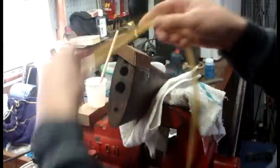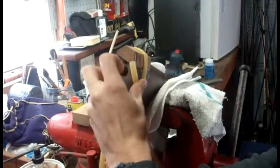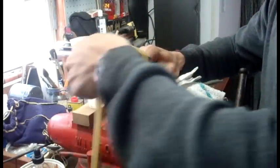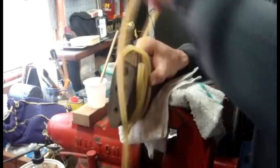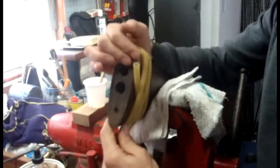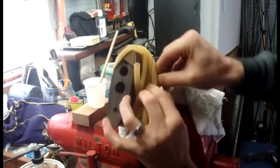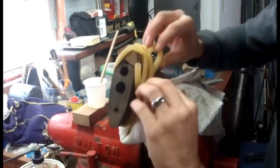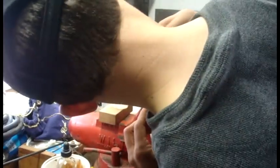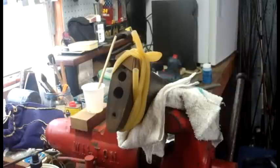I just want to take some surgical tubing, and then you just wrap it on here. What this does is help hold this piece in place really tight and really well. The surgical tubing is good because you can wrap it around pretty much anything. You can do any kind of stock repair or anything like that, whereas a regular wood clamp or a quick clamp just wouldn't work. It seems like that surgical tubing's nice too, because you can contour it in different directions and different tensions. Oh yeah. And you just put a little knot in there, like that. Just double check everything. Okay, everything's set up well. Now you just wait. We're going to let this guy sit up, and then we'll move on to some other things with this particular stock repair.